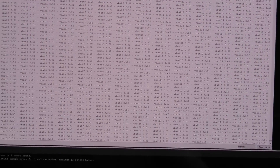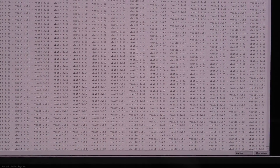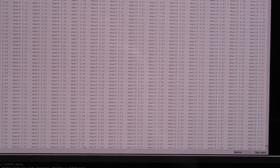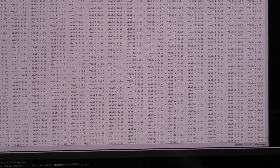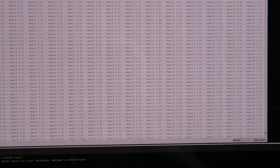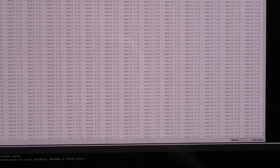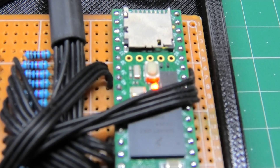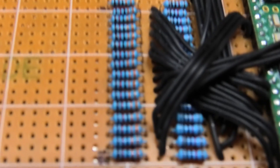When I started off I was reading in 10-bit, which is 1024 steps. But I knocked it up to 12-bit, then I enabled the internal voltage reference and it's stable as anything. That light there goes on and off every time it polls and as you can see it's constantly on.